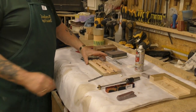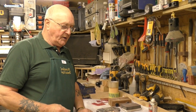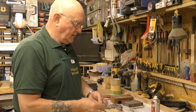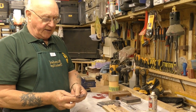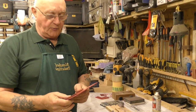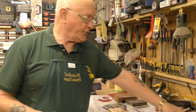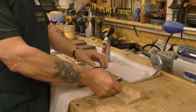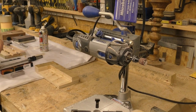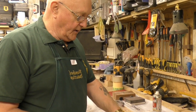That's really what you need for making a pen, and as we go through it you'll see how these different parts come into play. The first thing I'm going to do is prepare a blank, which will end up looking something like half of one of these. The problem with this Corian is that one side is rough — that's fine — but the other side is very shiny, which is not good for gluing. It needs to be roughed up a little bit. I'm going to do this on my little Dremel. These are going through a lot of stress, so it's important they bond really well.